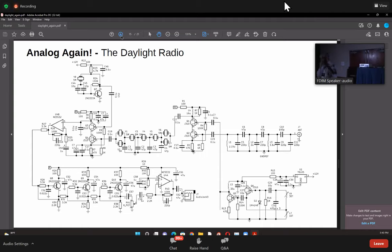And in this transceiver, there's one very weird thing that you will see. There are no transformers except in the power amplifier circuitry. Neither the mixer nor the modulators, nowhere except in the transmitter here. And here I have used two transistors, bifilar transformers. Even those can be eliminated very easily. I just didn't have the time to do this. You can use an L-match there because it's a narrowband circuit. A lot of people have problems winding these bifilar and trifilar coils. You don't have to do it.